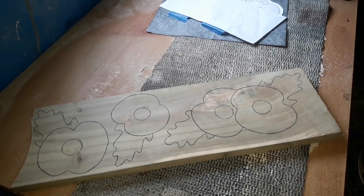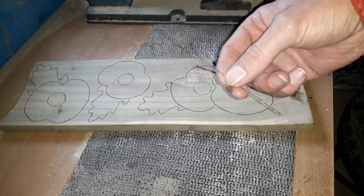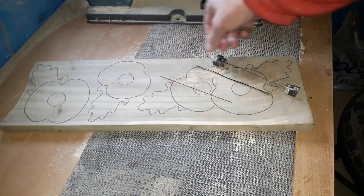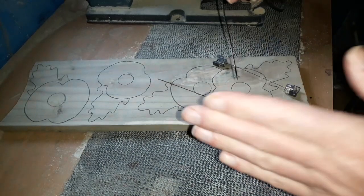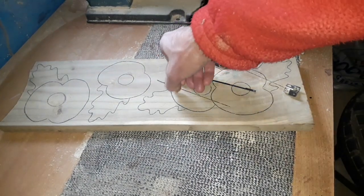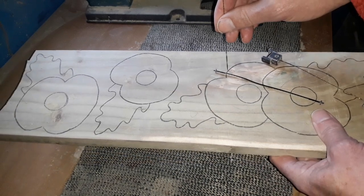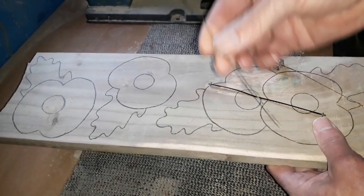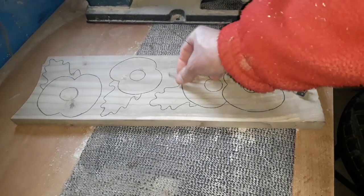The blade I'm going to use today is what they call a spiral blade. The good thing about spiral blades is they are round basically and will cut from any direction. On a normal pin blade the teeth are just at the front, so when you're cutting you have to push into the teeth, turn your wood around, push in, turn — on and on. With spiral blades you can push in for the first cut and then literally go left or right. None of that turning and twisting. They take some getting used to but I'm quite happy with them.